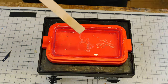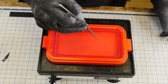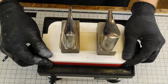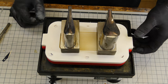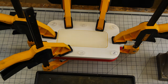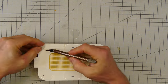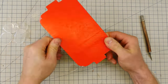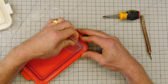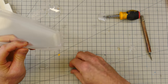I pour it into the first half of my mold. There's a little groove that runs around the top, so I make sure I get it in there really well and pop all the bubbles. I set this mold on my dental vibration table to raise all the bubbles to the top. I squeeze the mold halves together and hold them with a series of clamps to make sure I've got the correct wall thickness. Once it's cured I take it out and investigate — this one I set for overnight so it's fully cured.